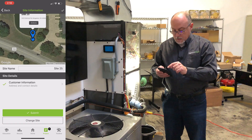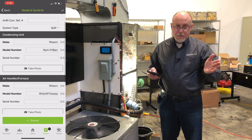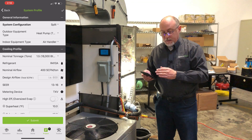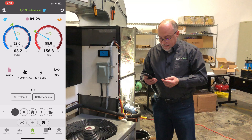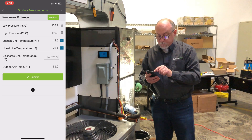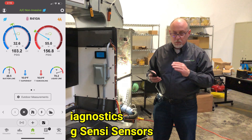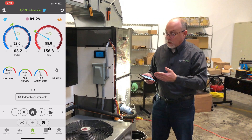I click 'Start a Project with MeasureQuick,' hit Open, and it asks if I want to live-stream the data — I hit Yes. Right away you'll notice all the project information — job site address, customer information — is already filled in from Sensi Predict. The equipment profile, model numbers, serial numbers are all pre-populated. When I go to the home screen set up in non-invasive mode, I can look at my pressures and temperatures. It's pulling outdoor air temperature from the cloud — showing 35 degrees — and displaying what my pressures and temperatures should be based on current load conditions.